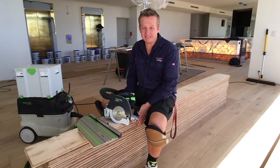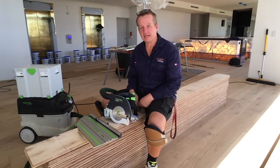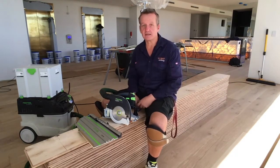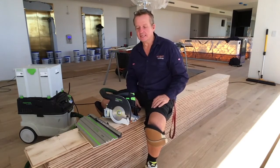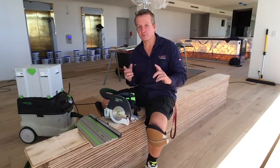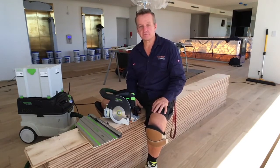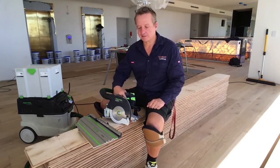The way we do it is we stack up a big pile of boards like I have done here, and we would flip the board over that we're ready to cut, measure it, set the rail on it with the square, and cut it. While it works great because we're not swinging large boards around in a tight spot — somewhere where you can create a lot of damage if you bang a wall, bang a chandelier, or heaven forbid one of those brass lifts over there.